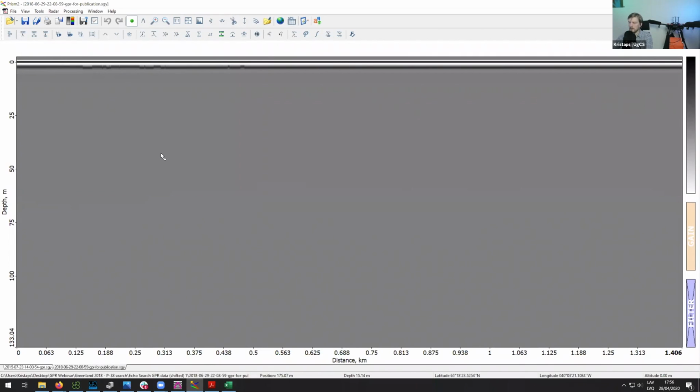Back then, actually, we did not have a few features. We did not have these waypoint markers, these red ones that you saw in other data sets. And also, actually, we did not really have terrain following. So this flight was done according to the barometer, and even in some places it was a bit dangerous because the drone wasn't really following the terrain, and as it was flying, its altitude was dropping. But so this was the initial data that they got after the first flight.